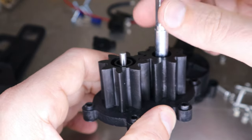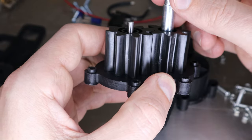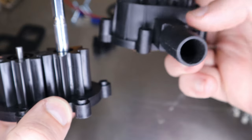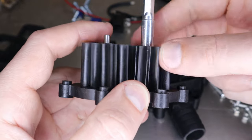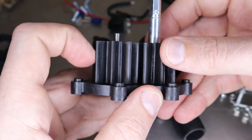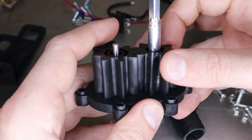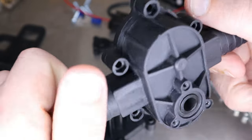Ideally this is what it's supposed to look like — it spins and the fluid goes around. As the gears mate, it pushes the fluid out of the void between the gear teeth, builds up right here, and gets pushed out the discharge side. It's a fun little pump and a fun little project. I'm going to do some testing on it as-is to see if it actually pumps — theoretically with a drill and gears this size it should pump a lot of fluid. Stay tuned to see what happens.